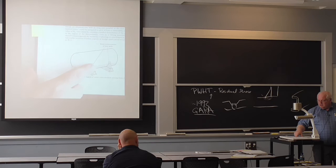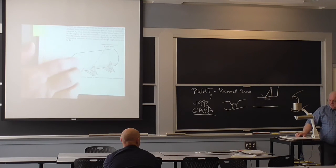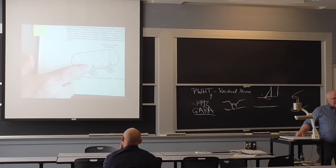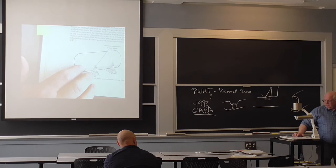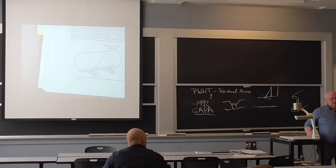And they would fatigue, but the boiler and pressure vessel code, if they had some bolted flanges and pipes coming out of it so you could attach things, it would leak at those welds, whether it's a saddle weld like this, or a pipe circumference weld around a nozzle connection. Doesn't matter. They were leaking. And it had circumferential welds going around the end caps and whatnot, but no doubler plates. ASME, boiler pressure vessel code, would require them, okay?